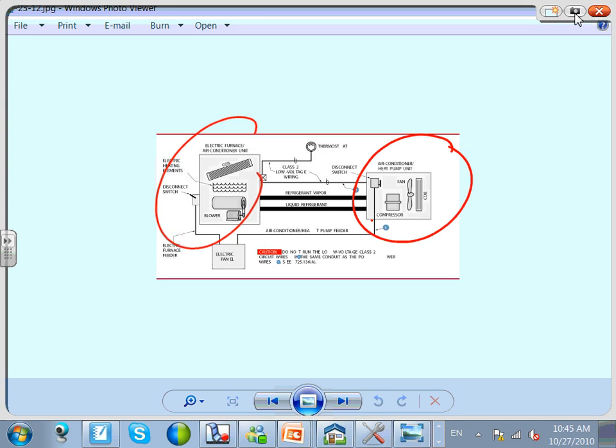Or you can power the two receptacles separately. Yeah, they won't let you run the wire. You can't use them as a conduit. They're not rated for conduit. Right, they're rated to feed one receptacle in and out. Why can't you buy a wire that's rated for that? Then they said, well, if it's not UL listed, then whatever. It was already roughed in, but yeah, so I only ended up being able to put one.